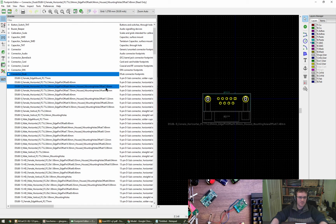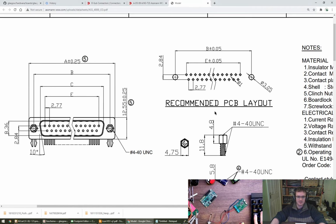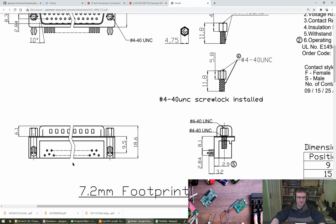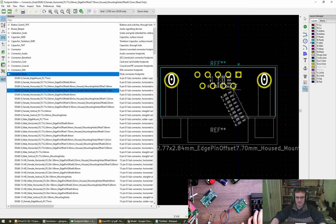So this one gives us 7.48 millimeters from somewhere to somewhere, unknown. So if we measure from that corner to pin 1, we get a Y of 8.18. That's the wrong thing. If we look at here, we've got a value of, oh no, 8.1, there you go, from the other pin to the front. The 9.2 gives us what? Can't lock onto that. That's 10, so this is more likely, I think. Oh, come on. Why is it you can only snap to pin 1? That's ridiculous. So that is 10.94.